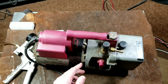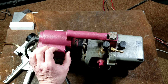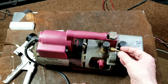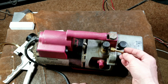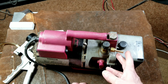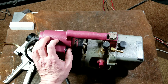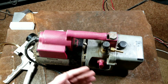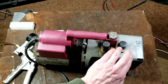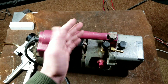You're always supposed to start these up with the isolation valve open. It runs pretty smooth. They do make some weird sounds — let me demonstrate. A lot of volume of air is going through there — it's like a weird kind of vacuum cleaner. You can hear those strange sounds always associated with vacuum pumps, particularly these rotary vane ones, where they make a gurgly sound when it builds up and then you remove the restriction or it builds up and releases vacuum.